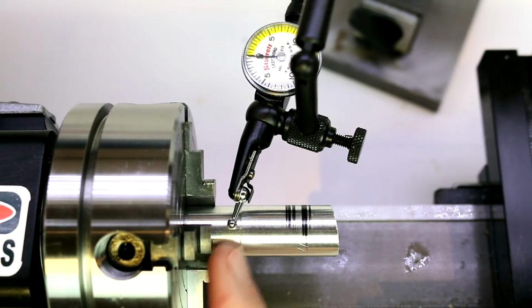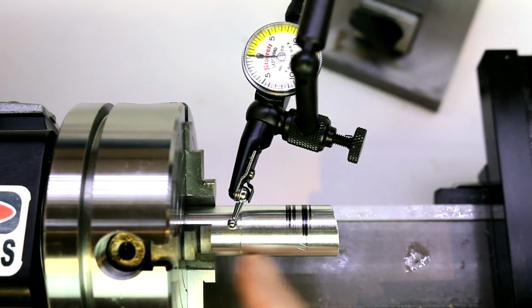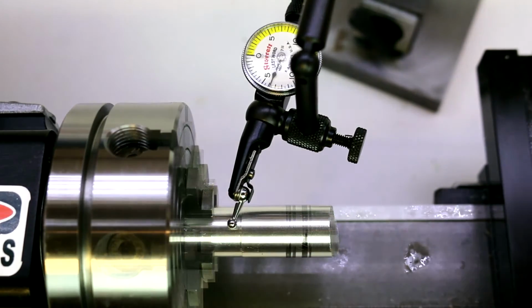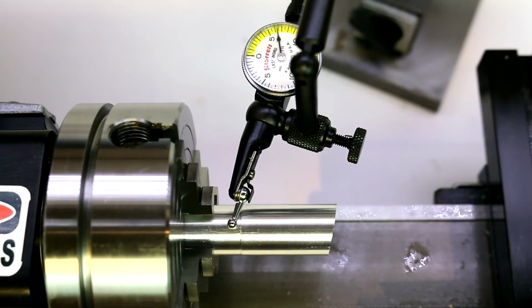So I'm wanting to center off of this piece of the shaft for our most accurate turning rather than this piece. This was a sample that we were working with in the 3-jaw to demonstrate how you can't reverse a piece and get accurate turning. And we're going to see if in a 4-jaw, we can get that accuracy without getting this type of a line and adjustment edge. So as we begin to adjust this, we're going to need to make sure that our indicator doesn't drop off the surface.